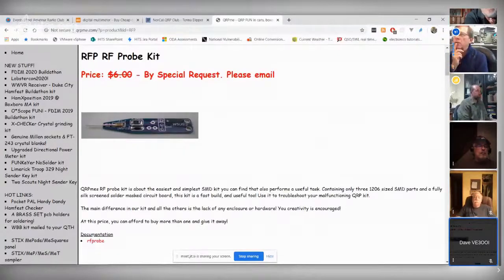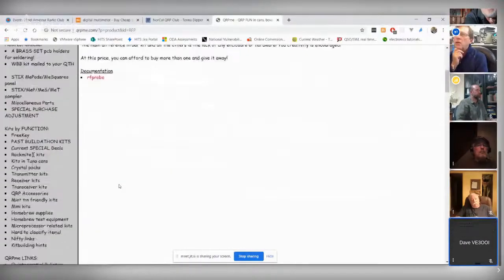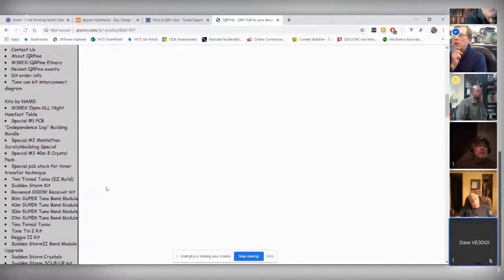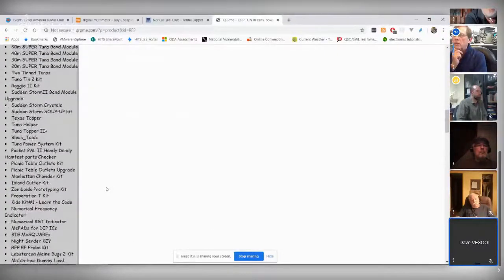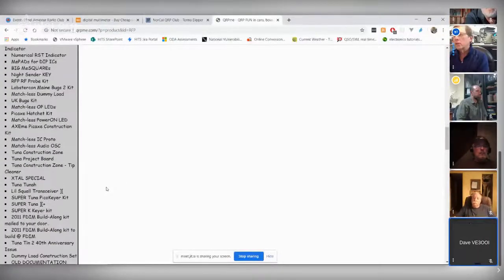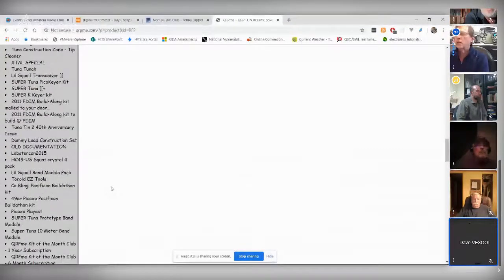Yeah, no, it was a fun project. I fried the finals in my SW40. When we talk about pieces of test equipment, I did not have a signal generator. And when I built my first RF measurement meter with the 8307, the only signal source I had was the SW40. So I put the key down on it, so it was constantly putting out a carrier, and I started messing around with the finals on it, and I was busy watching the 8307 chip's performance with the voltmeter and the scope and everything like that, and I wasn't paying attention to what I was doing with the SW40. So as I was writing down the data, I could smell smoke.